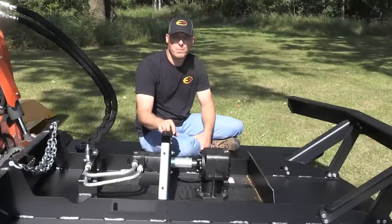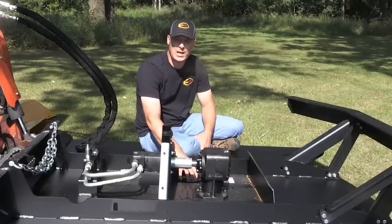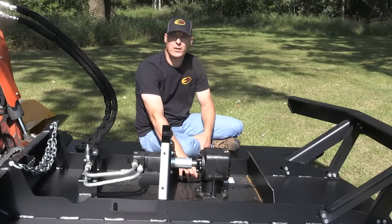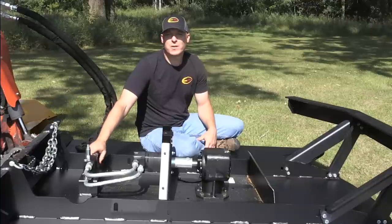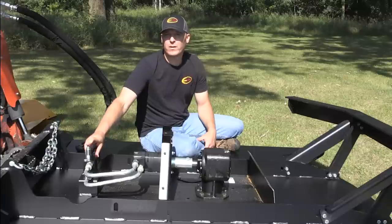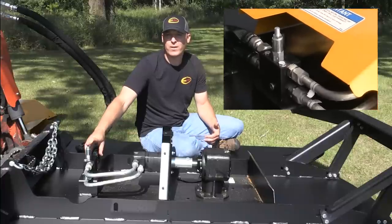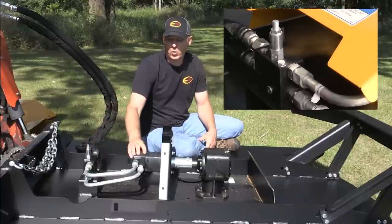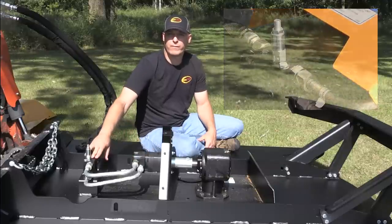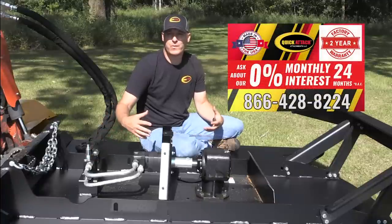This box is protected from all sides and from the top. It's also where we have the blade bolt access cover — if you need to change your blades, this is how you get at those bolts. On the back side of the drive system, there's a valve block with a very important safety feature: a relief valve plumbed into the brake circuit. When you shut the brush cutter off, the oil flow leaving the motor has to go over the relief valve, which helps brake or stop the system faster — it'll stop in under 10 seconds.